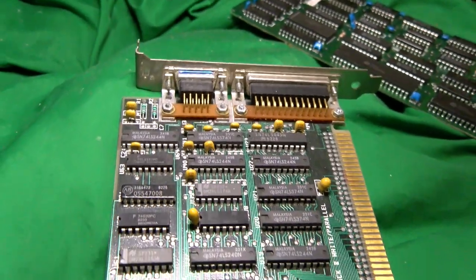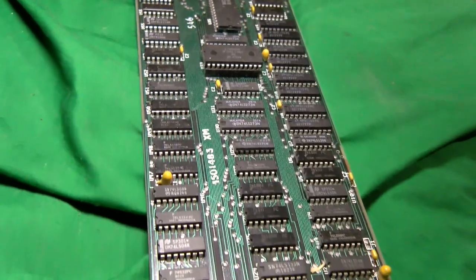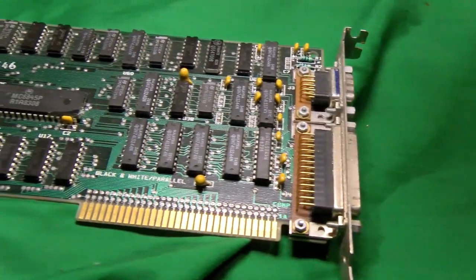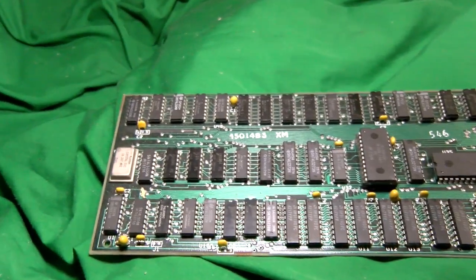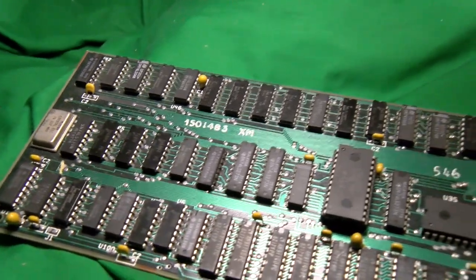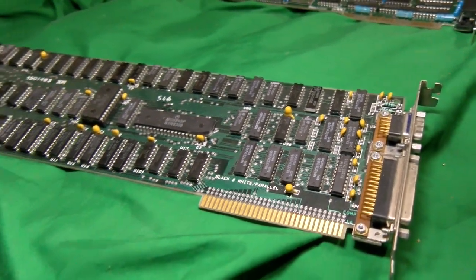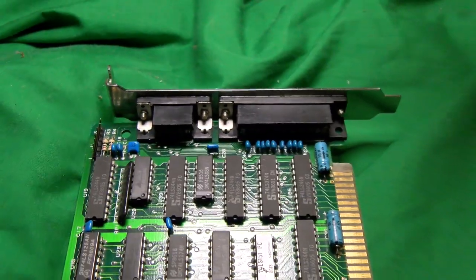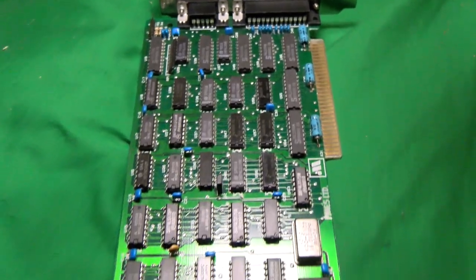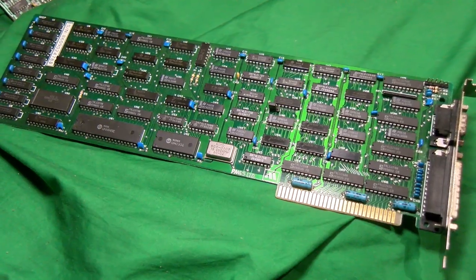Incidentally, you'll notice that the LPT port is often part of the video card in these older machines, and I think this came about in part due to the original 5150's limited number of slots. The thing to be mindful of here is that the first parallel port is actually at 3BC and not 378 when that parallel port is on a video card a lot of the time. So, when you're dealing with later expansion cards, there may be something to think about.